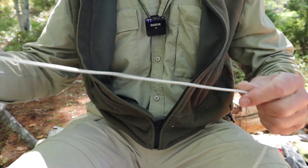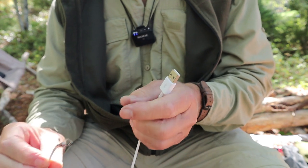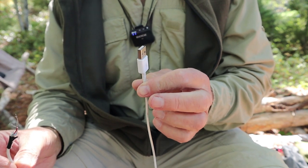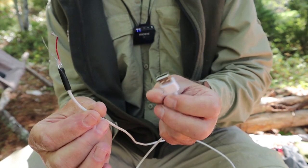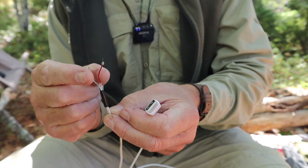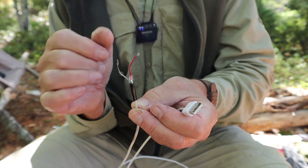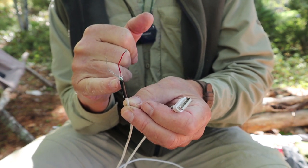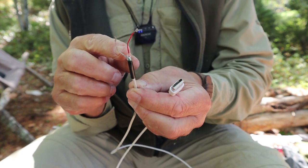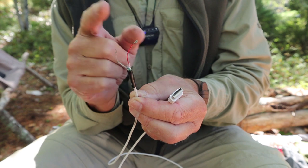The next essential item is your USB cable. It doesn't matter if it's USB-A, USB-C, or micro USB — they'll all work the same. I cut the end off and exposed four cables inside: there's a black or bare ground wire, a red one which carries the current, and often blue and green data wires. I cut the end off, removed the blue and green data wires, leaving myself with just the ground wire and the positive red wire.